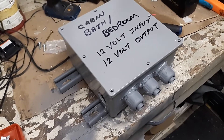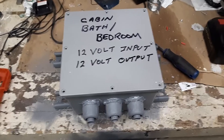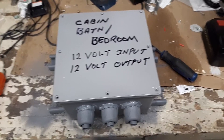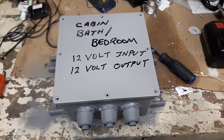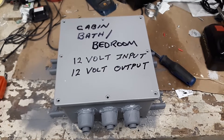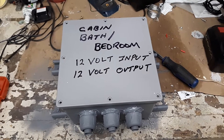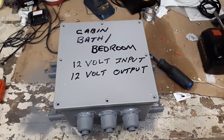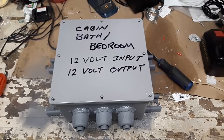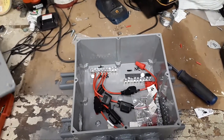I'm not going to be mounting this directly to the roof using self-tapping screws. I'll be using RV self-leveling caulk that's used to patch or repair RV roofs — it's self-leveling, very sticky, and UV-rated. What I do is put it on the roof, put the box down on it, caulk where I'm going to drill, drill it, and then caulk it up one more time. I have not had one leak yet. I'll open up the box and show you what I've done.